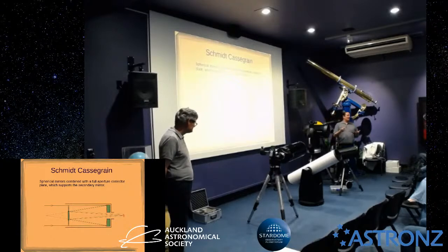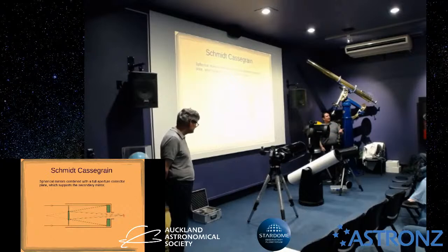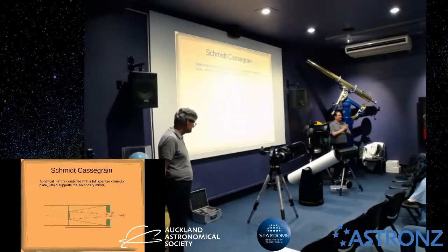So I use that. I use it in a spray bottle, but I don't spray the telescope. I spray clean tissue, and then what I do is I dab the surface really gently. Turn the tissue over, don't use the same piece again. Dab it. What you're trying to do is get any dust on there to stick to the tissue. So you put that on there, dab it on, pull the tissue off. Any dust on there is what's going to scratch your surface. Your tissue's not going to scratch your surface, but any dust or any contaminants on there will. I do that all the way around, really gently.